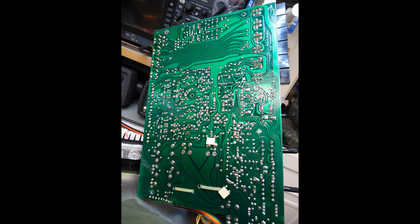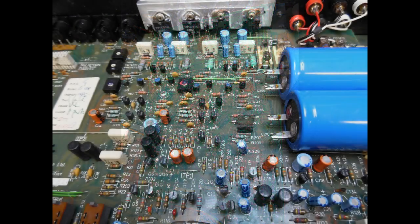The metal tab is the collector of these transistors, and it's used to transfer heat directly to the heatsink to maintain thermal stability and ensure the transistor doesn't go into thermal runaway, which could result in destruction of the device. One other point: when these amplifiers were designed, the design engineer would optimize the circuit for a particular device. The replacement transistor won't be identical in characteristics to the original. Remember that the output transistors are fundamentally driving current for the speaker coils, acting more as a current amplifier than a voltage amplifier.